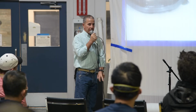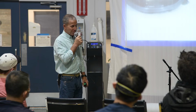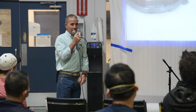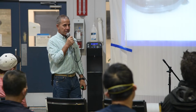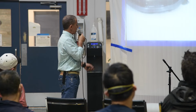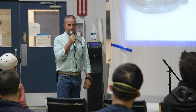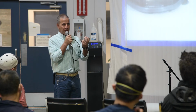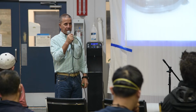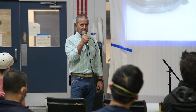On aluminum, this is actually on a windlass that's made out of painted aluminum. It's actually powder-coated aluminum. So this fastener has breached that powder coating, and that is going to turn into an ugly mess in a fairly short period of time. Now, in this case, the wrong size fastener was used, and so the head of that fastener is being pulled down into the hole, and it's turning the washer sort of into a tulip. So that's a material selection issue and an assembly issue.